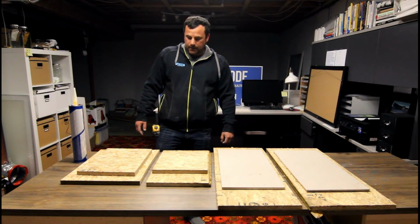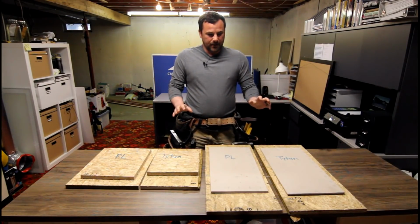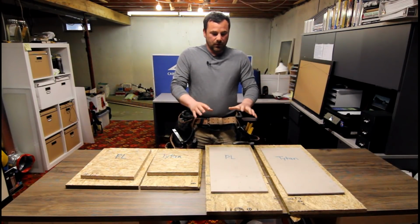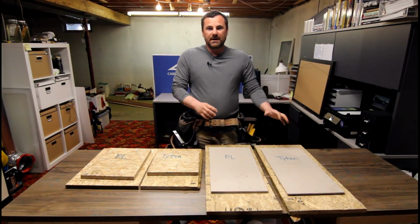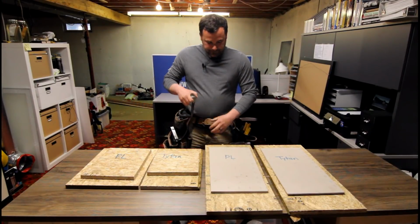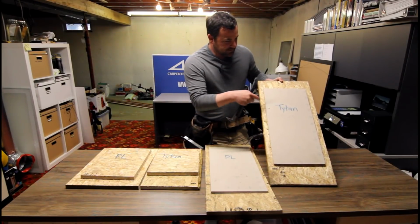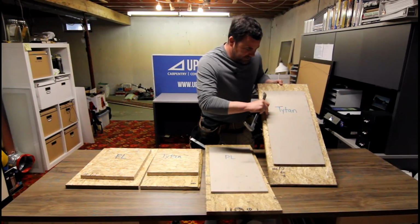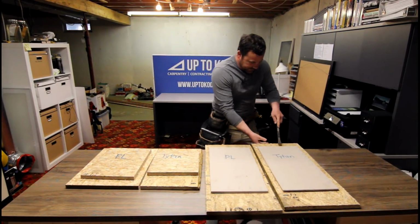Okay, let's come back. I managed to keep my hands off this for 36 hours, so now it's time to actually get into the nitty gritty. Did the glues work the way I wanted? Does the Fibrerock bond to the OSB like I want? Am I gonna feel comfortable using these products? Let's see here. So this is the Tytan glue adhesive. And even just this little blob that ended up on there is stuck on there like the dickens.